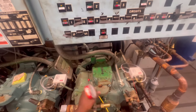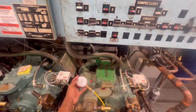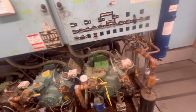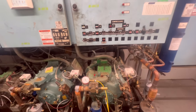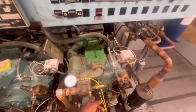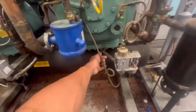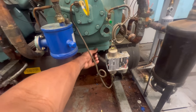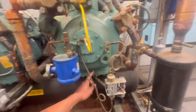If I want to get my net oil pressure, I need to subtract the suction pressure from the pressure I have off the oil pump. I know usually people get it off the crankcase, but let me know how y'all get your net oil pressure. Typically we just go off the suction pressure, and whatever pressure we get from the pump, that could be our net oil pressure. We'll see if I get a reading down there at the crankcase.